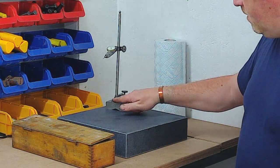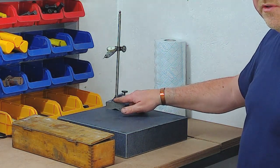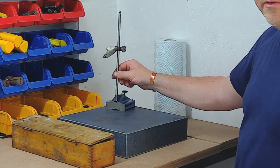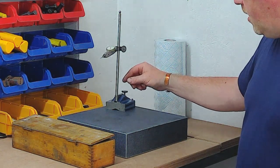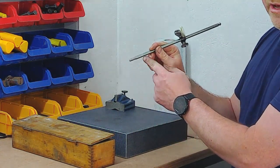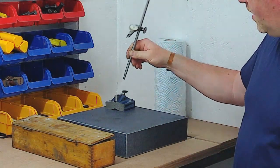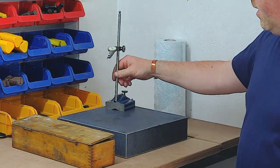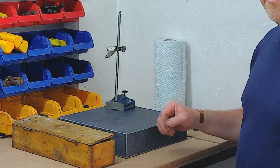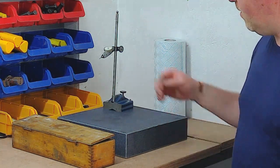One is drill and tap a tiny hole in the front, put a flat on the bar, and just a tiny grub screw in there just to nip that in place, because obviously this needs to be rigid. It's no good as it is while it's rocking about. Second option is to turn that end section off completely, that's slightly undersized, and then turn another diameter on there that's a much tighter fit, almost a press fit, but then obviously that means you can't take the thing apart, so I think the grub screw idea is probably better, but I'll take feedback and advice from people, and there's no rush on that, but it's there waiting to go.